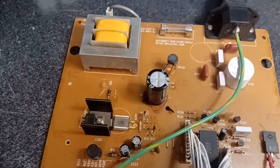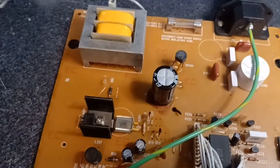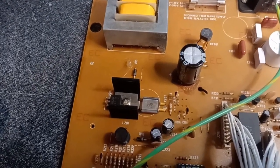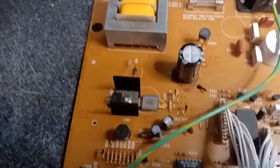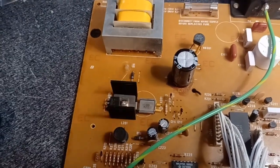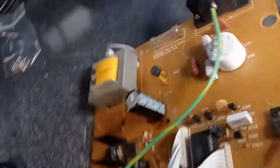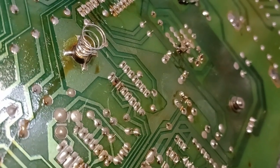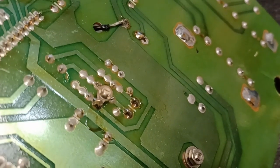But I've got another crystal here, some 10 megahertz crystals. I know it's not a full size, but the housing and the clip down that uses that transistor to warm the crystal, so it still should work even with that crystal set in there and warmed up. The adjustment on this one is on the bottom, right? Let's see if we can find it. Oh, right there we are. Right there is the adjustment for the crystal.